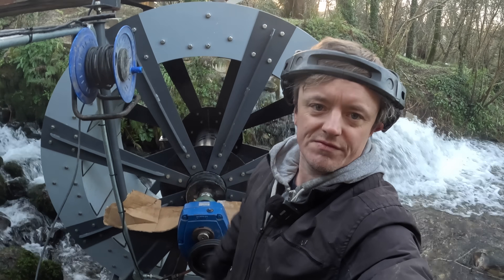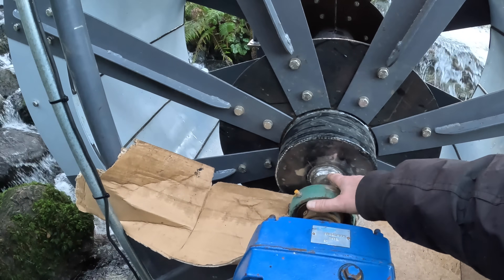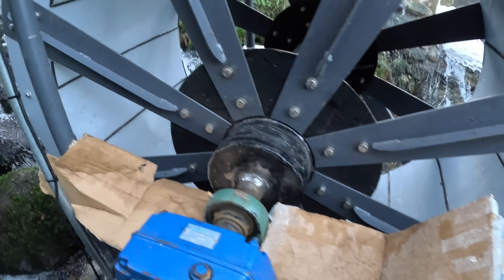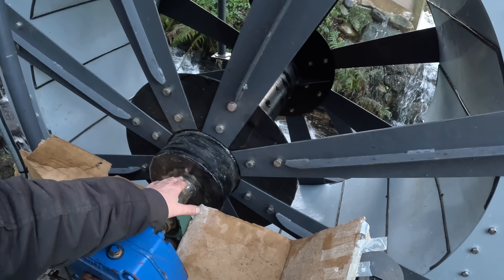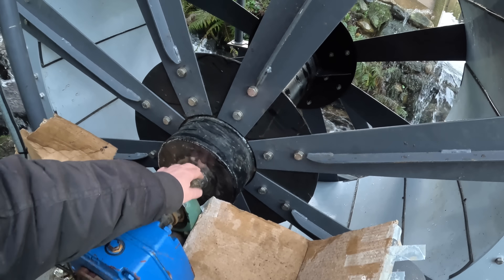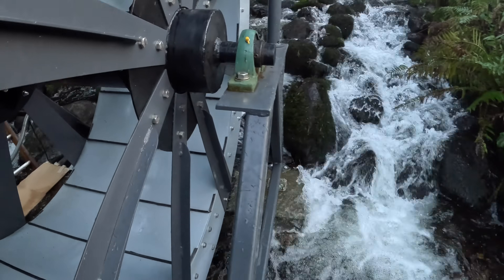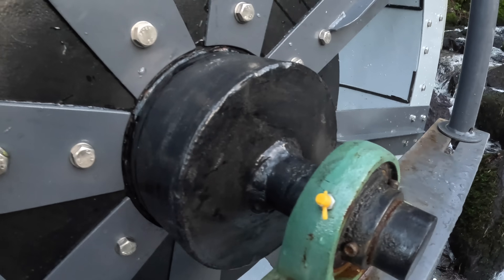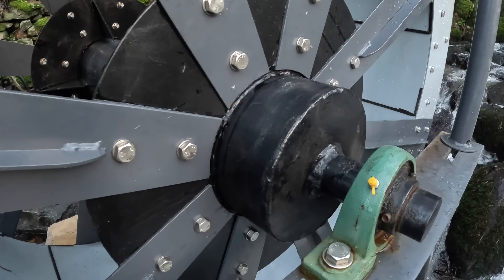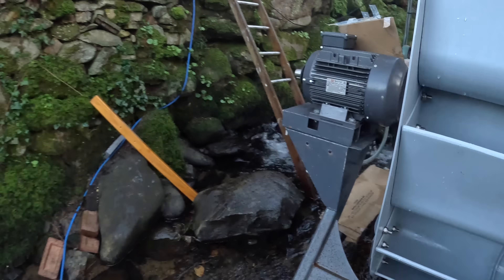What I find quite interesting is I must have welded this just too hot and deteriorated the steel, because for maybe a day it was running at full output with that completely cracked and sheared. All the torque was being transferred off this one side, and the other side is fine. I don't think the area isn't big enough to hold it — I think I must have just welded it too hot. We'll correct that today.